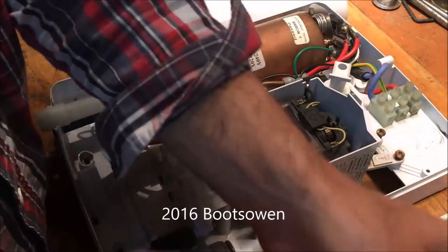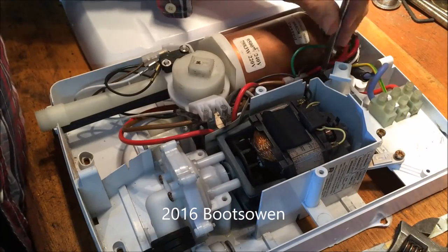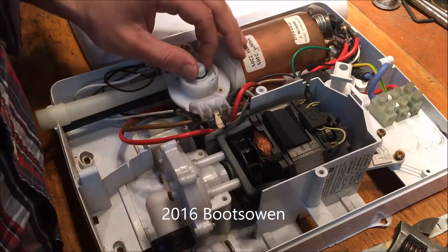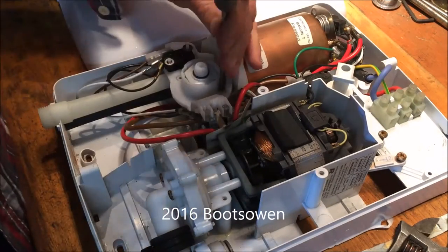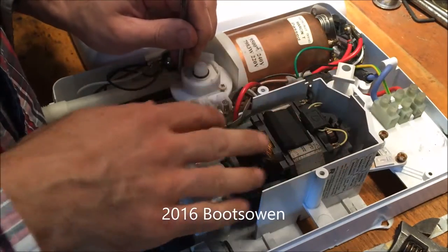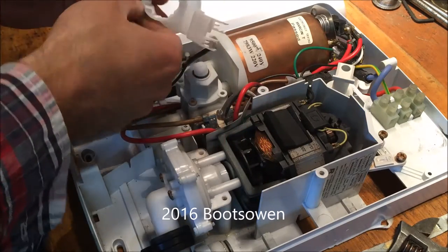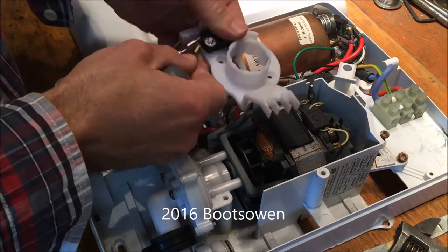The Redring Expressions 570 pumped electric shower. There's a micro switch that turns it on and turns on high and low power. There's a micro switch that regulates the element on and off over here. That's the cover for the water pump — the water flow regulator. That's the water pump. You know, in an electric shower you've got 220-volt electricity, a motor that's completely open with electrical contacts and brushes in there. You've got water coming in here — everything's sealed and it's fine. Except you've got water right beside 220-volt electricity and you're standing naked in a shower, completely soaked. It doesn't seem safe, but apparently it is.